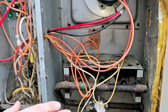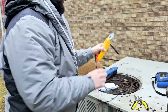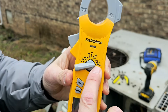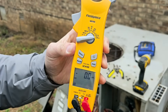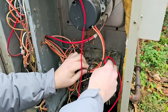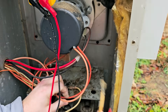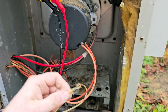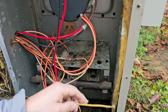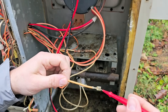Now what do you need to do to measure the signal? You need to take your meter. See where it says µADC? That's microamps. We're going to take the wire off the flame sensor. One thing I like to do is I like to measure from the flame sensor back to the board — that way you take the wire out of the equation.